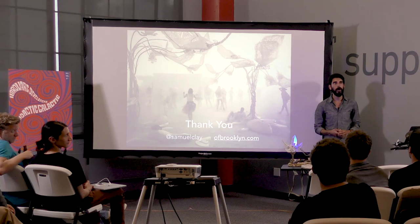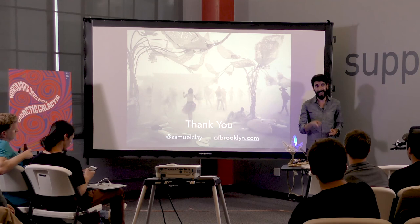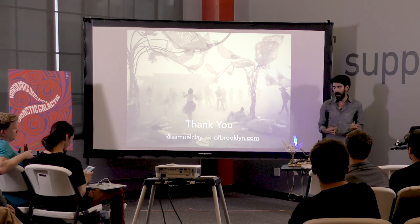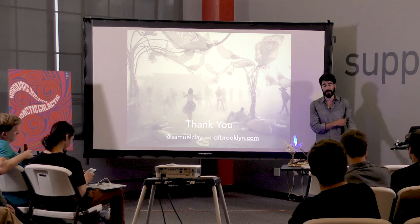Q: How much time did you work on this? A: I spoke to Rohan in May and Burning Man is end of August — about three months, part-time. I went out to the playa a week early. Steve had an idea while we were cleaning up: what we should have done is put a current measurement ammeter on the board and run a power-on self-test, turning everything on individually to check if current is flowing. If not, switch on an indicator light — green means all good. That would have cost nothing, been easy in firmware, and we just didn't think of it. I would definitely do that differently.